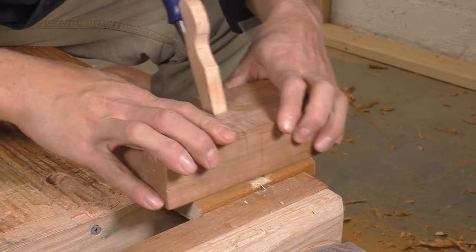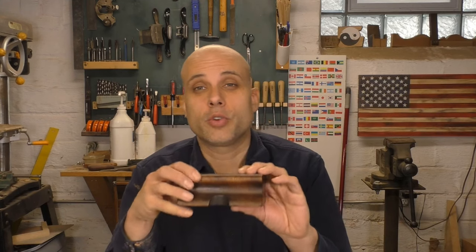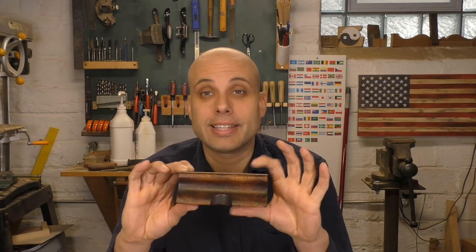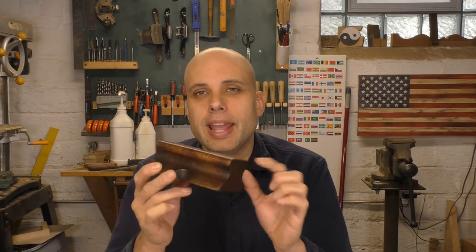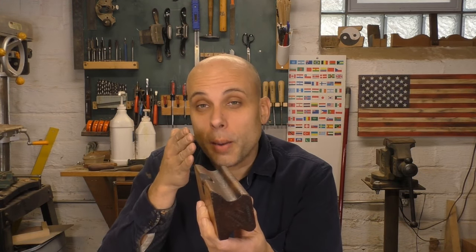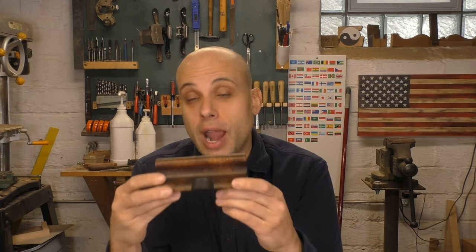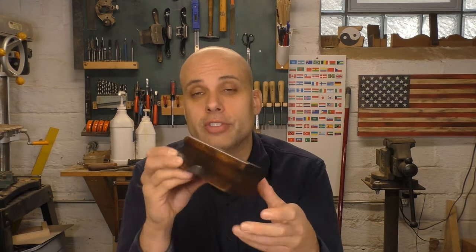So now my tool works, but it's much too big and blocky — very difficult to grip. One of the things that's great about the vintage tool is it actually has amazing ergonomics. These curves make it super easy to grab and hold on to, and it's comfortable — you can use it for a long time. I want to duplicate as much of this curvature as I can, but I think the original maker probably used some specialty tools for these really deep cuts. This looks to me like he probably used a molding plane or maybe a large gouge to get this really long, perfect curve on the front and the back. Some of these were made out of scraps of pre-made railing, but this one wasn't — it's not symmetrical and the profile's all wrong. The craftsman actually cut these details.